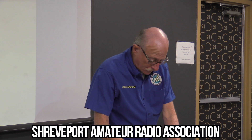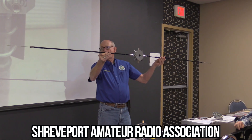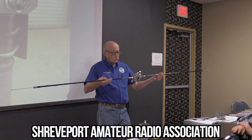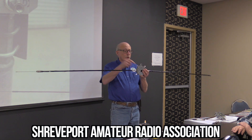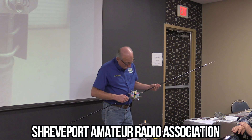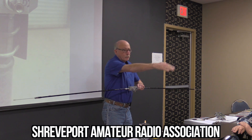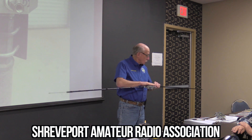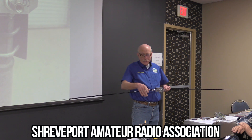What you've got when you put one of these together is this. Jim brought these six-meter antennas, so they're kind of short. If I had my 17-meter antenna on here right now, I'd be banging against the wall. He can put a bunch of different bands on here; I'm only interested in the two and that's fine. Something else I noticed he did today — he put marks on here so if he's looking up at his antenna, he knows which way to turn it, because your radiation pattern is going to be broadside. He also used a steel box, which I wasn't thinking. He can put a mag mount on top and put a two-meter antenna on it. I can't on my aluminum one — it won't stick.